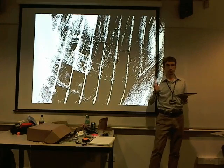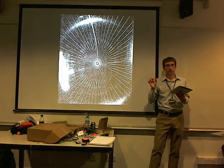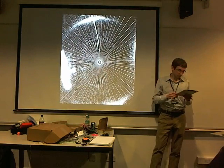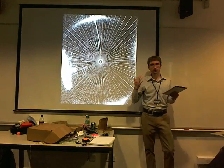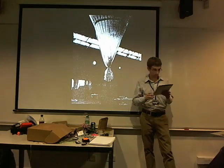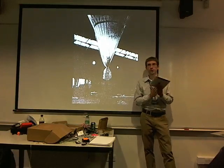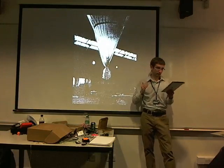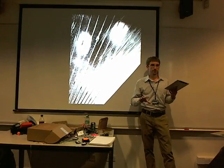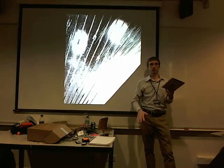The pressure phase is exacerbated as the balloon goes through the jet stream where temperatures get the coldest of the whole flight. They've regularly seen flights where good temperature sensors showed the jet stream exposed the balloon to as low as −90°C. Films that were too weak were improved by laminating Mylar to them, getting some strength properties of Mylar with some heat-sealability of polyethylene. Seam failures were greatly improved by forcing manufacturers to do standard testing — pull tests in cold chambers — and rating their seam techniques properly.